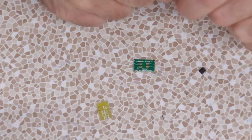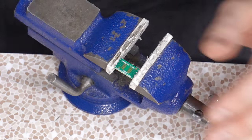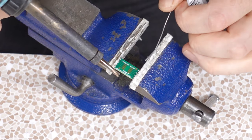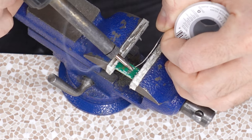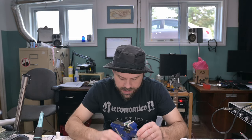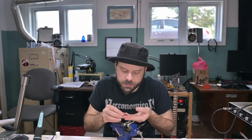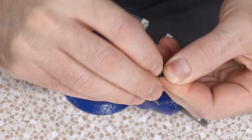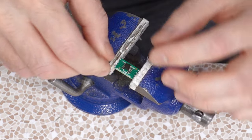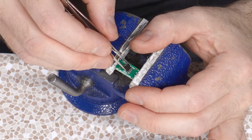I've gone and chucked this board to the soft jaw vise. I went for the paper towel. I'm gonna grab some solder and we need to tin these. I'd like to think I could do this without flux. I keep going for the paper towel — gonna have to get used to that. Now I gotta figure out what side's pin one. I got so much shmoo on this I can't see the label anymore. It's gonna be this way.